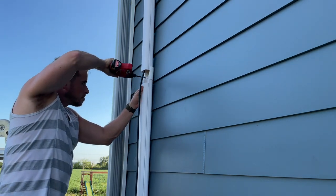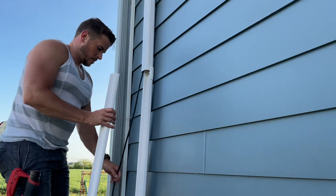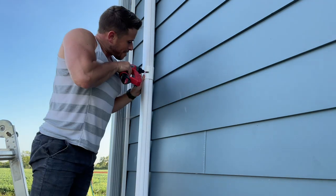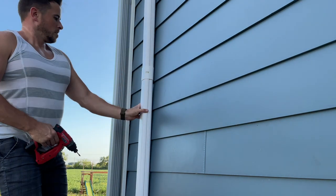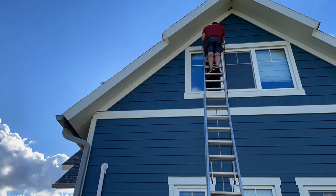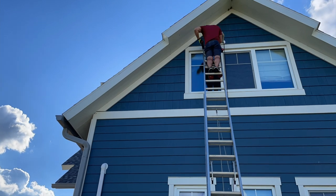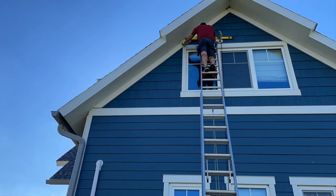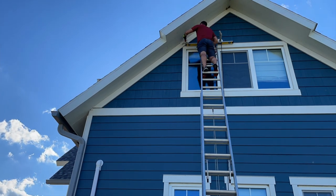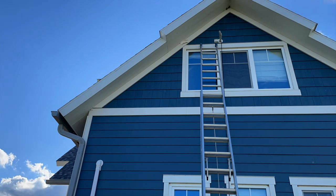On the other side of my house, all I have holding these up is the single screws in the couplers. While I don't think I'll have any problems, if I do I'll have to go back and fix those. Adding a screw so the straight piece is securely fastened at the coupler point makes the whole line set stronger and more secure against the wall. Here I'm setting this line set up to run horizontally. When running horizontally you also have a condensate drain running alongside your line sets, and this is just gravity fed — so you can't run it level. The typical standard is about one quarter inch of drop for every one foot of horizontal run.